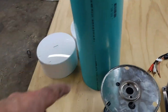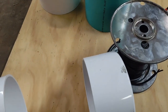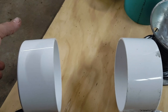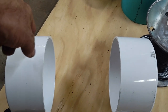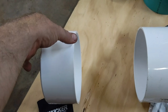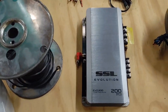The way this works: you have a cap here, cap here, with a short section of pipe in between. I cut a hole in one of the caps for the speaker. One tube will have the speaker and the amp mounted in it. The other tube will only have a speaker — the amp will power both. The accessory wire comes out of this tube, along with an auxiliary cord, and it'll also be Bluetooth compatible.